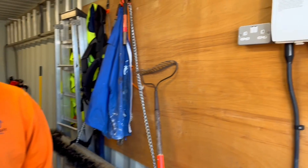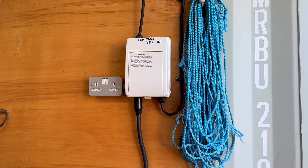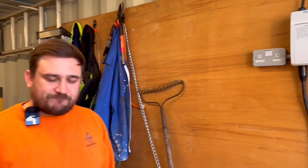Be interesting to see what other people say, what they would code it. I've spoke to my CPS scheme and I've used what I know about the situation, so yeah — C3 for me. If you've got anything to add, please leave it in the comments below. Do you agree, or would you firmly say you need to sever the earth in order to put this on a TT system? I'm under no illusion that I would want to TT this, and at the end of the day it still has a code — it still has a recommendation under a C3. But on an EICR, can we code this a C2? Is it potentially dangerous and needs sorting as soon as possible?